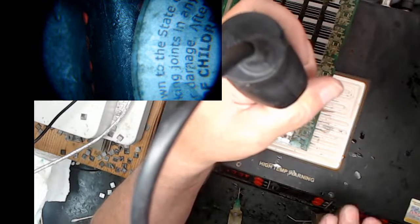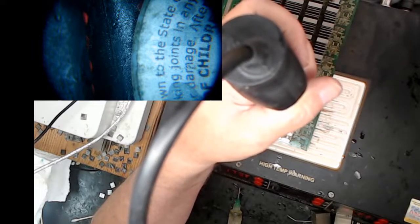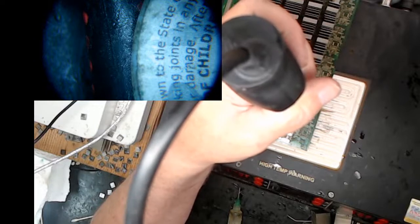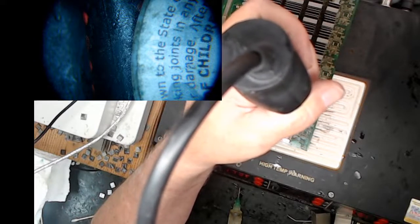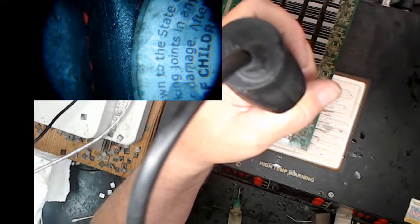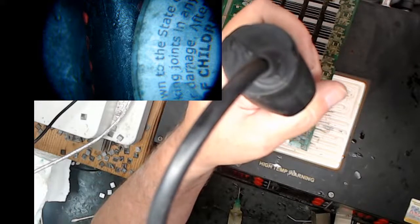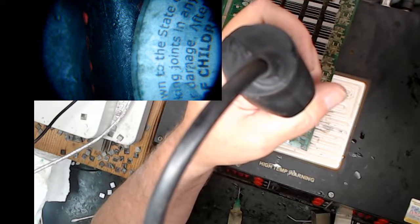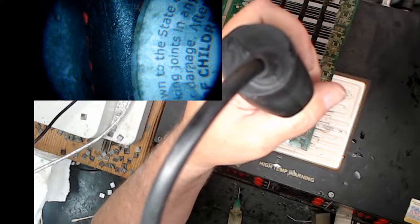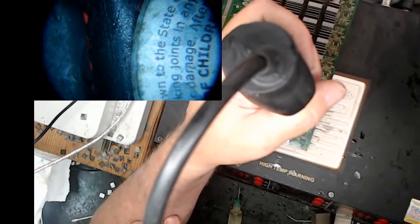And the reason the hot plate is so nice is if you were to just do this on a cold chip, it would expand too fast and the chip might crack. I call it blow up, but it doesn't really blow up, it pops. So having it already this warm, just heating it up a little more to get the solder melted doesn't seem to hurt it. I mean, I'm sitting here blowing 456 degrees centigrade air on it for quite a while. I gotta get that board up to that temperature.